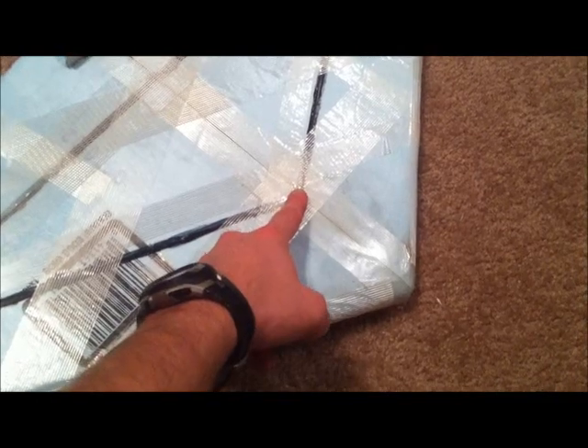Once that was cured, I had two separate halves I needed to join together. On the bottom here, you can see the carbon spars I put in — I made kind of an upside-down A. I looked at a picture online about spar placement for the actual Zephyr 2, and it looks like it's about one-third distance from the leading edge — about 5.33 inches from the nose — running all the way out to the edge. Then I put a middle rod in for some more support and to help connect the two pieces.